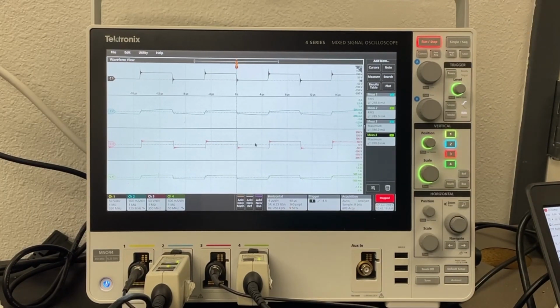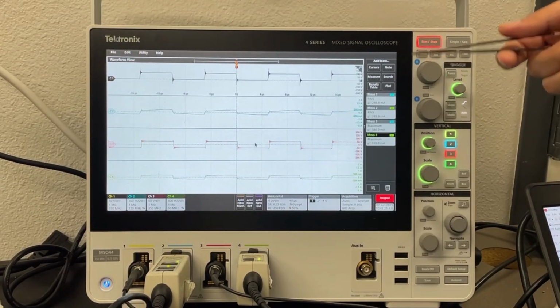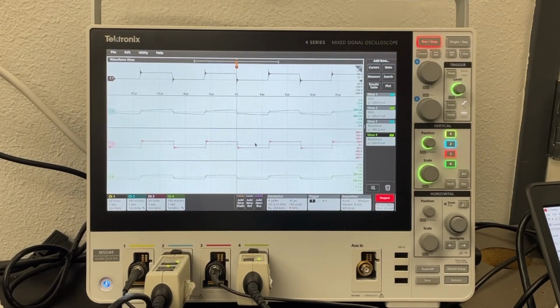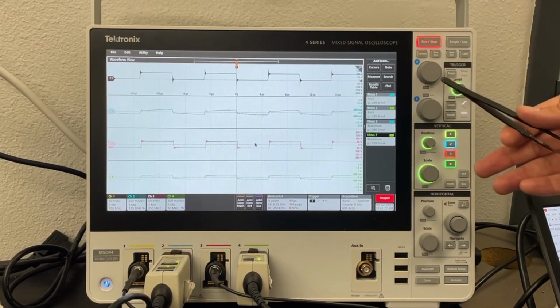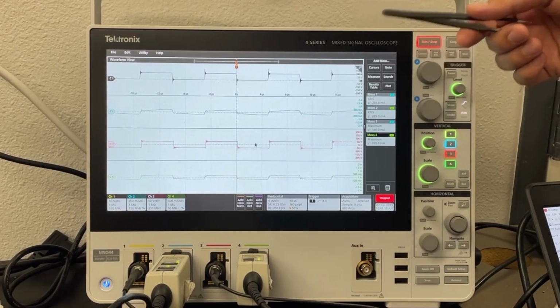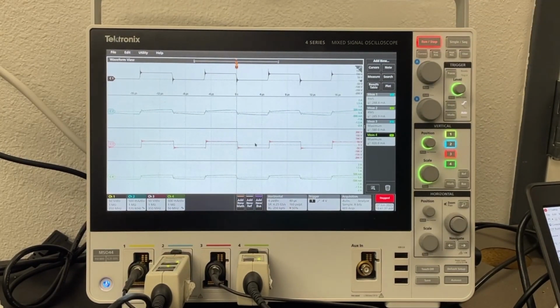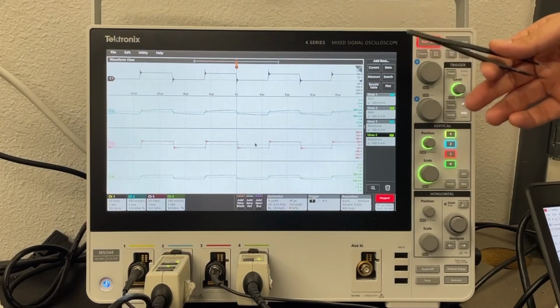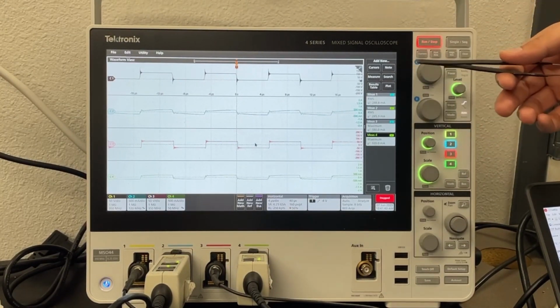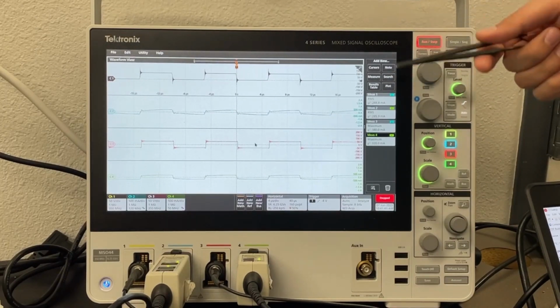And it means that we will have less conduction loss for the switches, and also through the theoretical analysis of the circuit, we saw that this modulation facilitates the ZVS condition, and we will have less switching loss as well. And totally, it will help to reduce the total loss and improve the efficiency of the converter during the EV charging cycle.